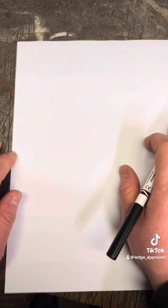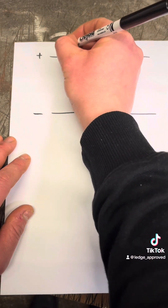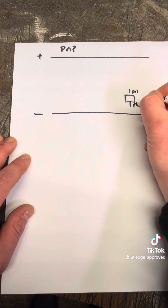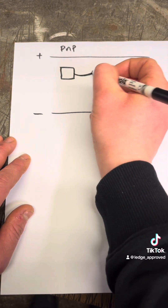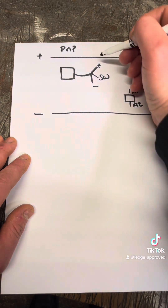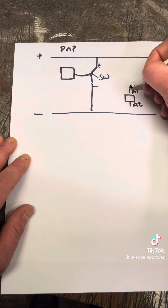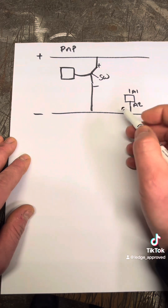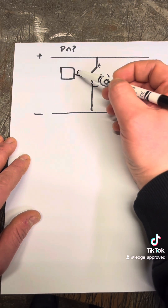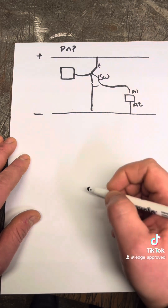So what that's going to look like on a schematic is you're going to have your plus and your minus voltage, then PNP. Why you'd wire that up is if you've got your coil from whatever you're switching to. So you've got your sensor up here, that's going to have three cables coming out — you've got your plus, your switch, and your zero volts. This will be coming up to your plus 24 or whatever your switch voltage is, this will be coming down to your minus, your A1, your A2 will be going down to your common zero volts, and then your switch coming down to your A1. Because you've got your 24 coming down your plus, through your sensor, switching on the transistor, coming out then down your switch voltage, and it's powering your coil.